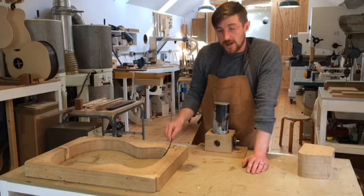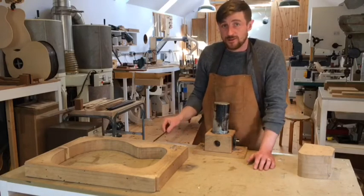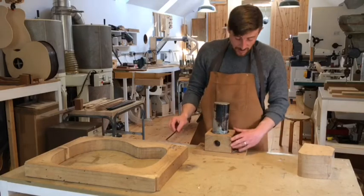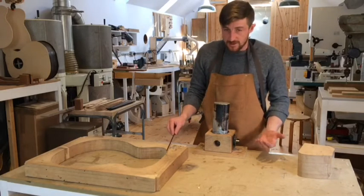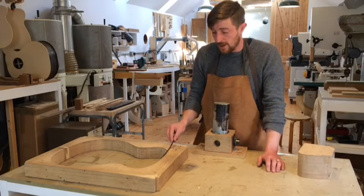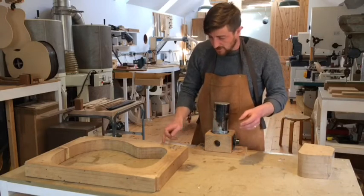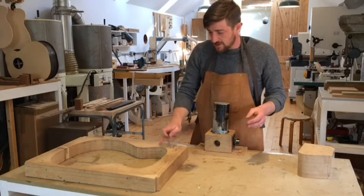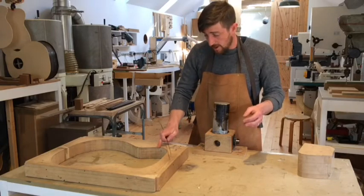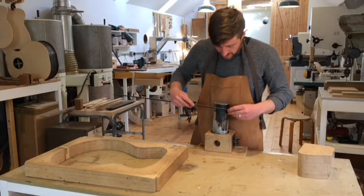Because it's wood it bends the same way – it's a heat-and-bend process really. Bending iron set to high; I tend to bend on high and then quickly. I'll just start the bend now, so I get my orientation correct – obviously this would be the soundboard face and the upper bout – and then just start the bend.